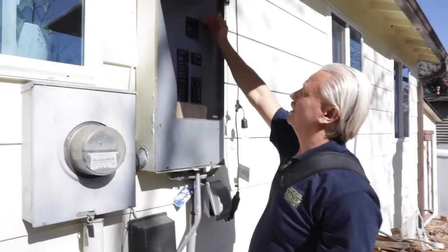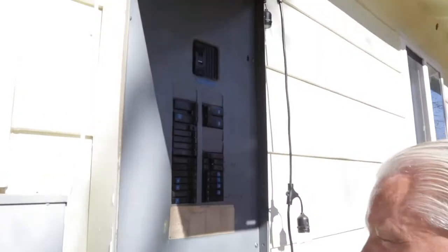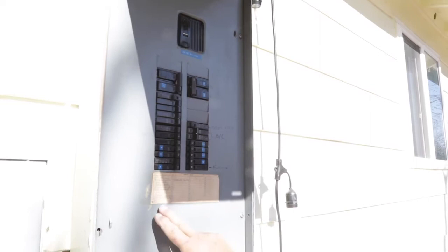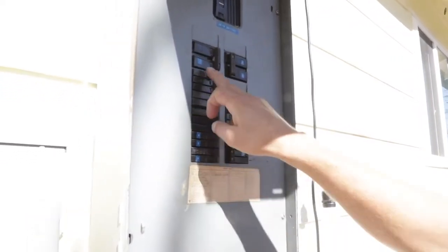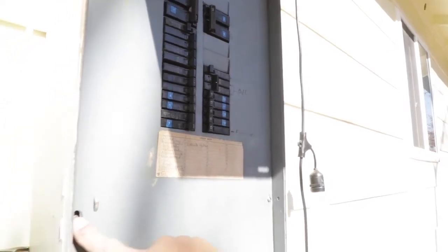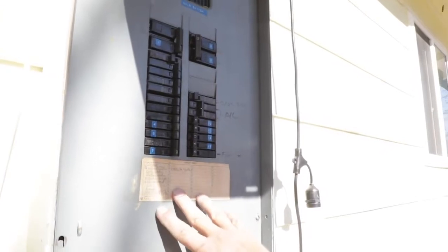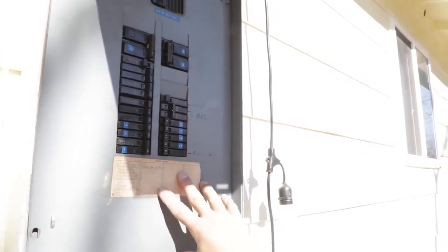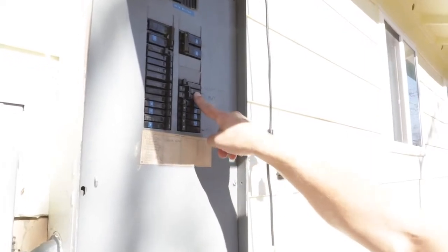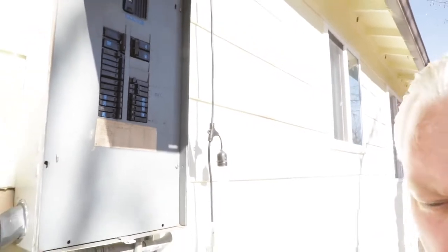Open this up. We want to make sure we're not too high above the ground. Looking at this, it looks like we're missing some of our legend — one, two — kind of mismatched. So I would write this up: one is missing a dead front cover screw, and breakers are not labeled completely. Now remember, we wanted to look at the air conditioner — see what our data tag was to see if we had the right breaker. 25 amp, and it was rated for 20 to 40, so we're okay.